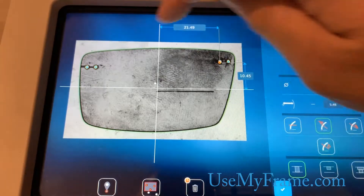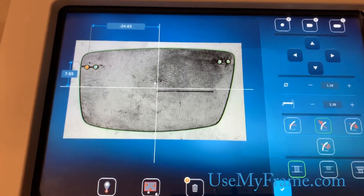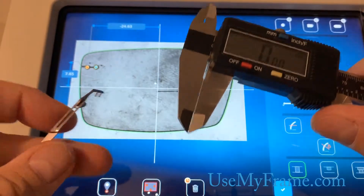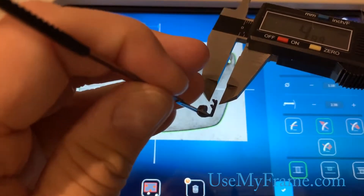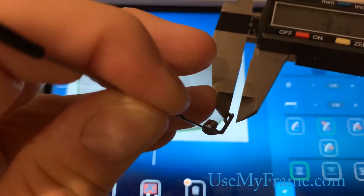We've got four holes now. What I like to do is start making sure they're all even and set up correctly. First thing is the diameter of the holes — if you're not sure, take the posts and use a micrometer. Make sure it's zeroed out. If you look closely, there are actually little ridges on these posts that help them stay in. If you get in between those ridges, you're going to get a smaller-than-average reading.